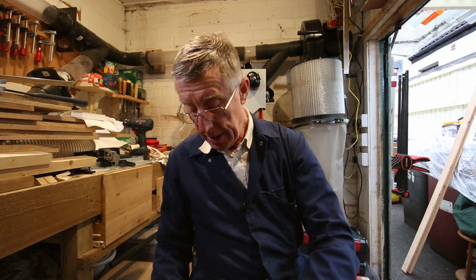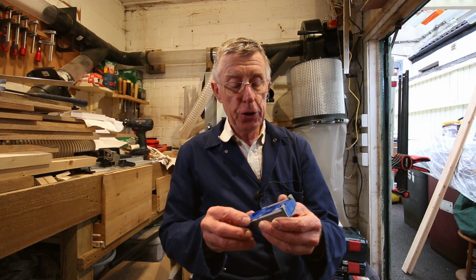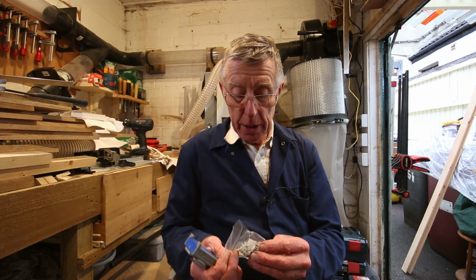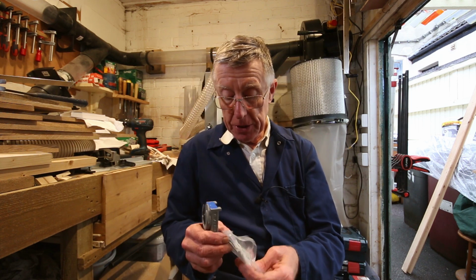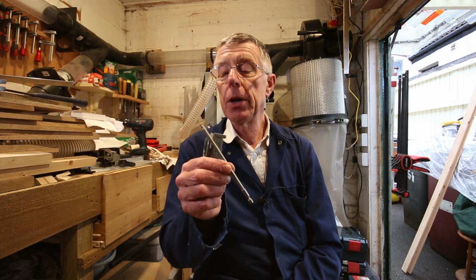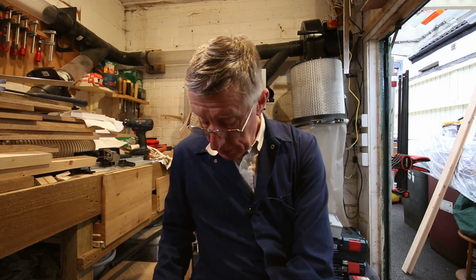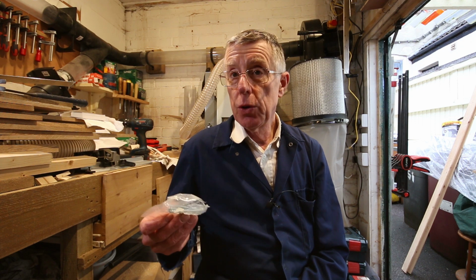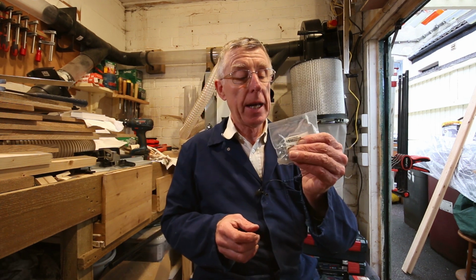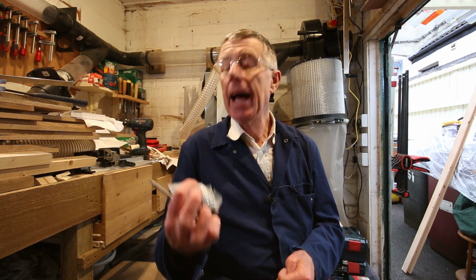It comes with its own drill that is designed to go into those holes. You can position where the holes appear on the target piece of wood, and although it does come with screws specifically for the screwdriver, because the head is a square Allen key really, it does come with that, but I tend to use ordinary screws, and I've found that perfectly acceptable. With these, you can get deeper into the hole using this driver, but you don't have to use them.